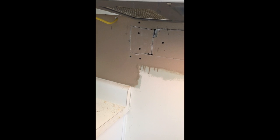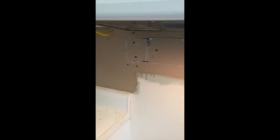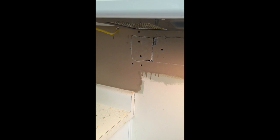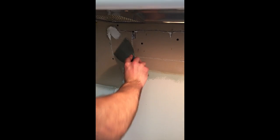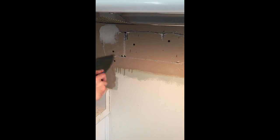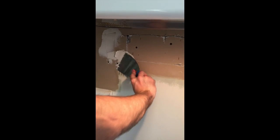Adam and I are going to be doing a backsplash later this month, so we just put the piece back up there, popped a few drywall screws into it, and we'll make it look prettier later. If you are not doing a backsplash, you'll probably want to put the screws a little bit more around the edge to make sure it doesn't end up folding out. Now Adam's going to fill it in with plaster, just get the holes in, and then we'll be ready to do the backsplash.